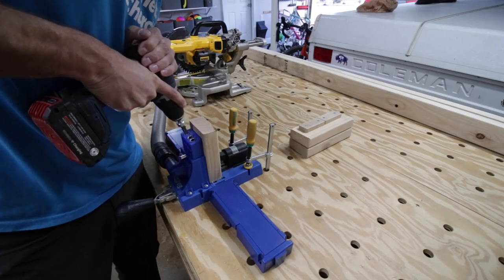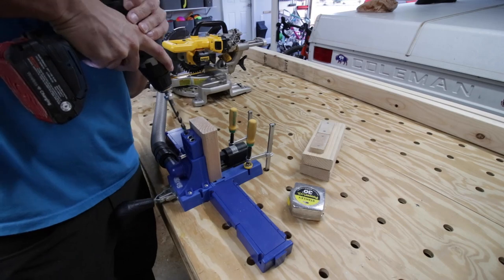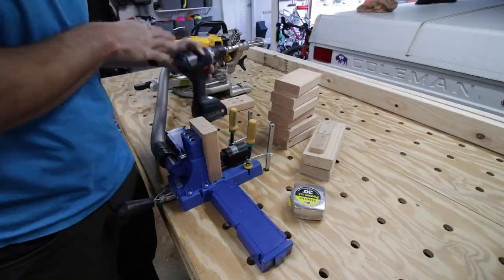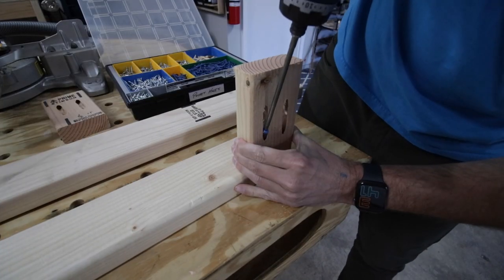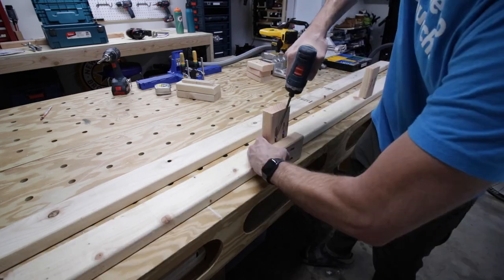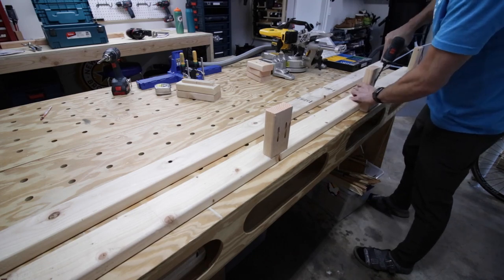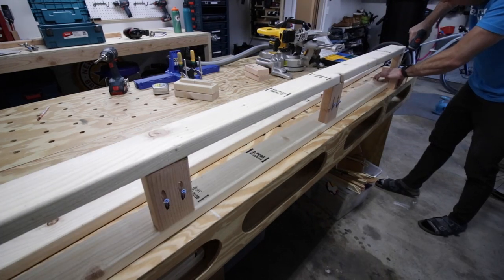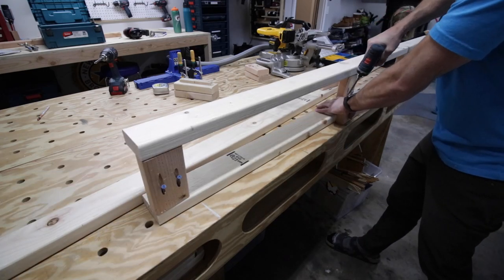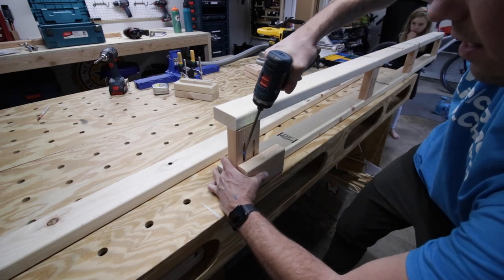That's the main way I'm going to assemble the frame of the fireplace. Assembly was pretty easy — I laid out my posts and then attached my spacers with pocket hole screws, spacing them out wherever felt good. Once I had one side done I flipped it and attached the other side, going down the row. I had to have my helper come hold it while I was leaning out over the table to keep it in frame, but we got it all done.